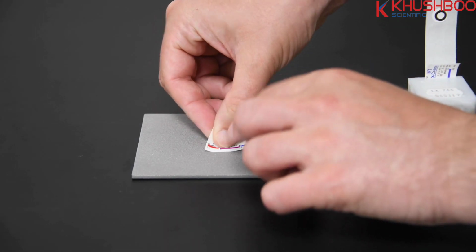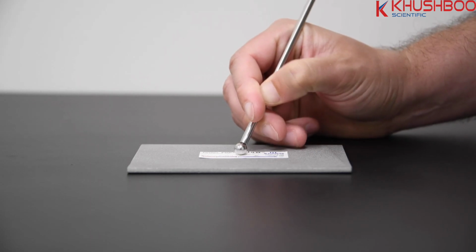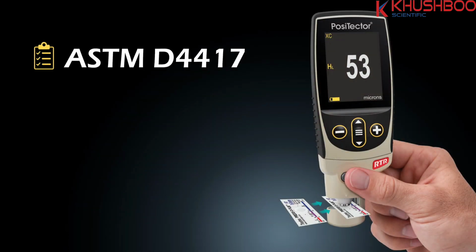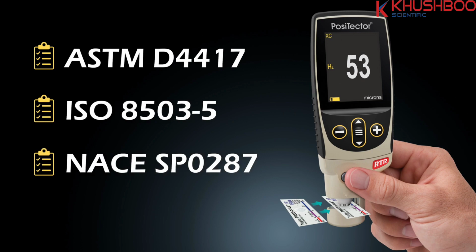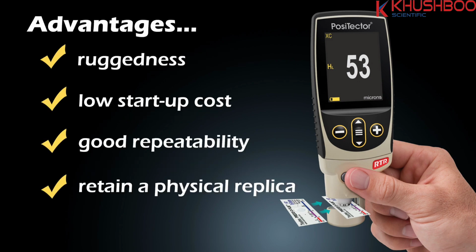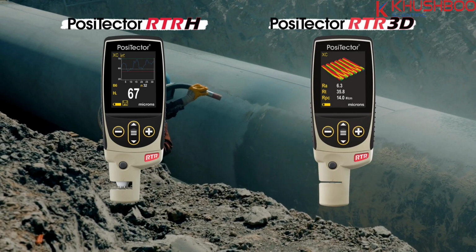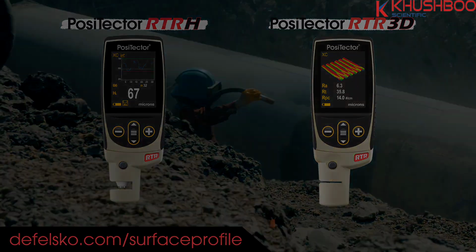Replica tape has been used to measure the profile of abrasive blasted steel since the late 1960s. Its operation is described in a number of international standards, including ASTM D4417, ISO 8503-5, and NACE SP0287. Compared to other methods, it has the advantages of ruggedness, relatively low startup cost, good repeatability, and the option of retaining a physical replica of the surface being evaluated. DeFelsko's PosiTector RTR-H and PosiTector RTR 3D make this widely used and understood method even easier.